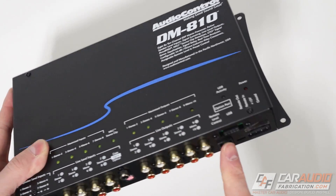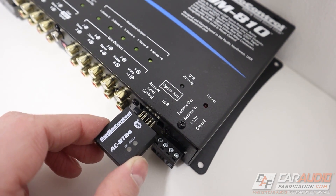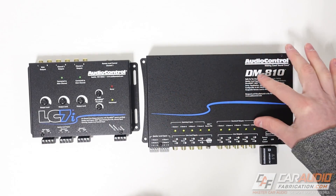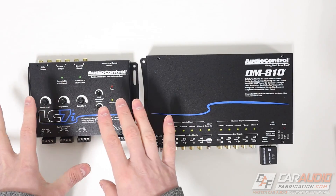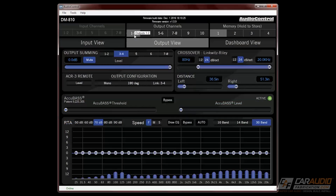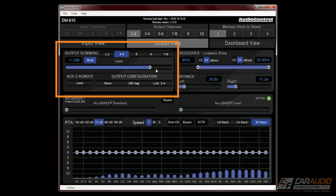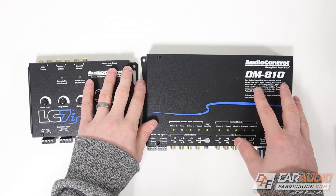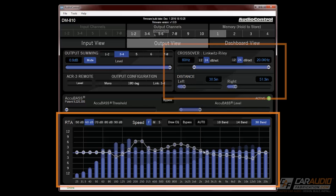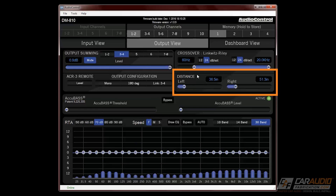The added functionality of a DSP comes through being able to connect to a computer via USB, or in the case of this DSP, we can add a module that allows us to connect over Bluetooth and control the device with our smartphone or tablet. The absence of any dials or controls on top of the DSP is where some of the confusion comes from — why would I pay more for a DSP? Once we get into the software, we can still do signal summing and control levels for each output channel. But that is where the similarities end. The DSP also gives us the ability to control crossovers, equalization on every output channel, and time alignment for each channel.